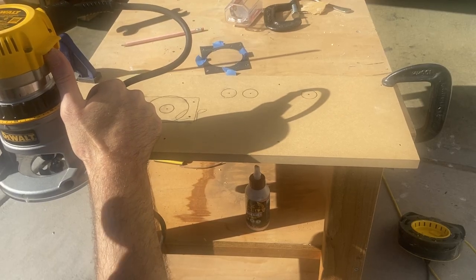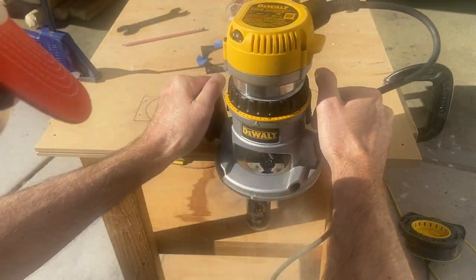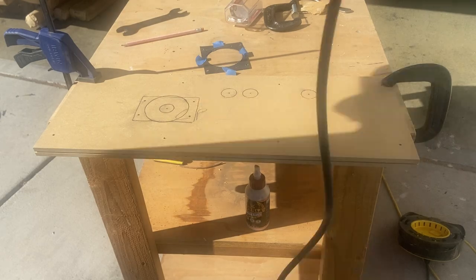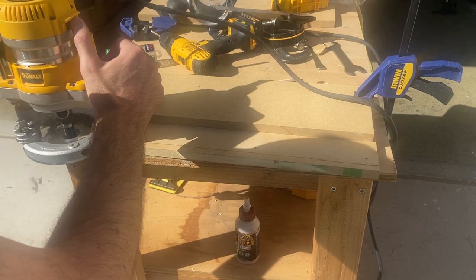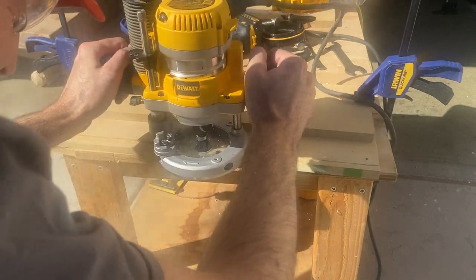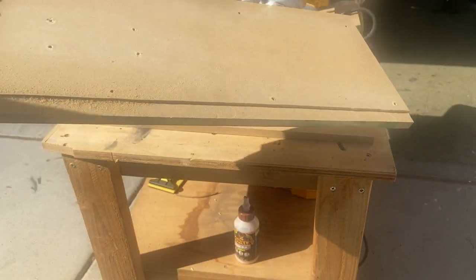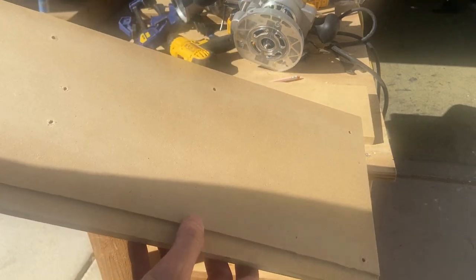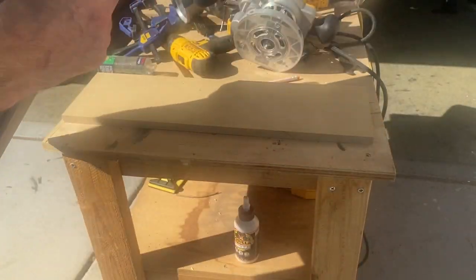Before we route the hole out for the bracket, I'm going to cut the groove for the T-molding that goes in the front of a Nintendo control panel — we're simply going to use our router and cut a groove. We're also going to cut a beveled type of edge where the back of the control panel goes underneath the bezel bracket. You want to make sure the control panel is going to slide underneath that bracket that is underneath your bezel.